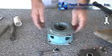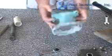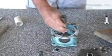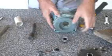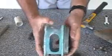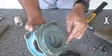I'm going to take the pump seal out. This is our adapter bracket. We just want to drive it out of the backside. Set it down, a piece of pipe, chisel, most anything. Just work it out. As you can see, our seal, it came out. Don't know if you can see it or not. These little ears, they just have a tendency to get pulled in a little bit.